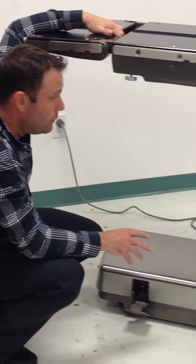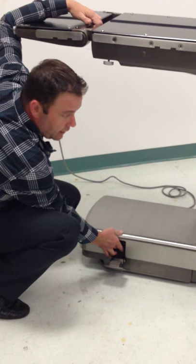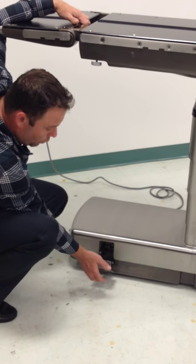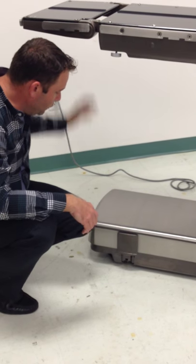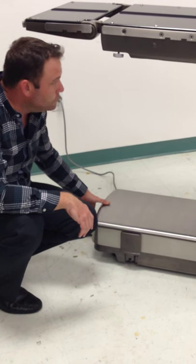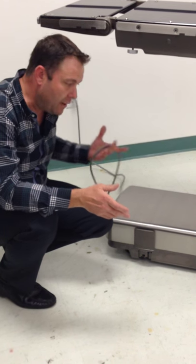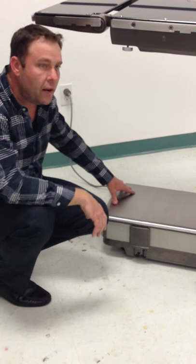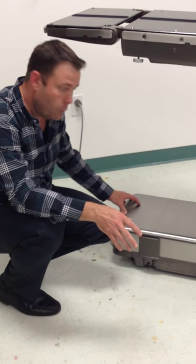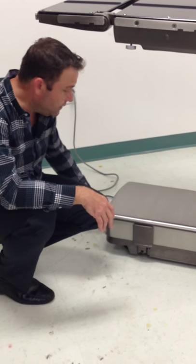Also in the well where the manual foot pump is, there's a switch in here that will control the locks as well. So if the hand control stops working and you need to unlock or lock the table, you can put your fingers in here and lock or unlock the table with this manual switch. It's just a little hidden, so you need to be aware that it's in there. This on the front is where the cord plugs in for 120-volt power to charge the batteries or work the table. Being battery operated, you don't need this trip hazard in your OR. You can charge this table overnight, and it will have plenty of battery to do any procedures during the day, then charge it again at night when procedures are over — so you don't have a cord hanging across your OR providing a trip hazard for surgeons and staff.